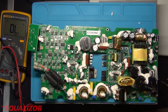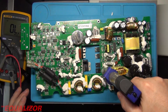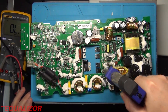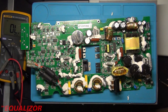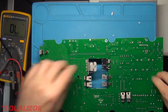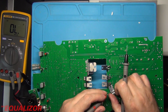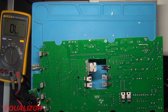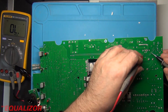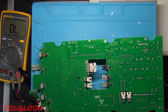Let's see if we can remove that. Now we need to test it out of circuit and see if we still have a short on two of the pins. And we do. I wonder if we still have a short now on those plus and minus rails. And now we don't. So that's probably our problem — well, it is our problem. It's a direct short circuit.